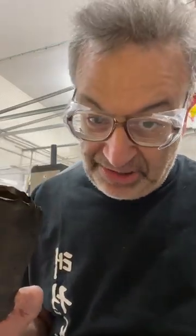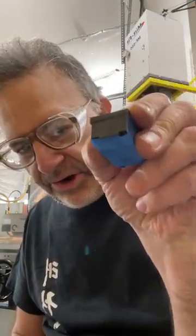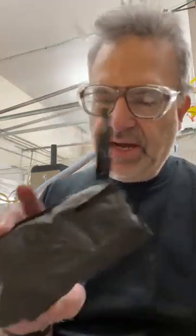I did not do a good job on this one. The blocks did not come out shiny. They came out gray. But everything's getting ground, so it doesn't matter. So when you pull the block out, I used tongs to pull the red hot block out and get it onto my, no, I didn't use Kevlar gloves. I just used leather welding gloves. And I get it onto my little rack. And then I hold it and I go in there with my big snips, and I try to get the top cut off. And then I try to shake the bag out.